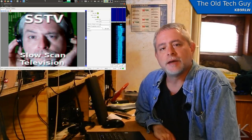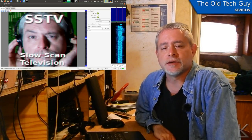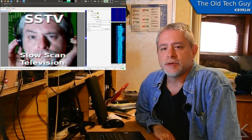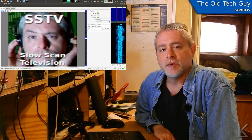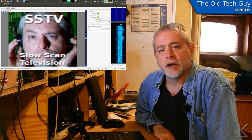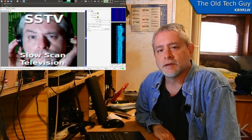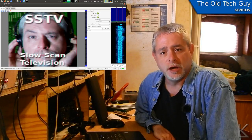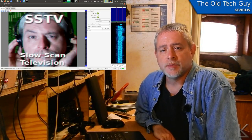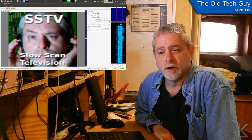It's pretty neat. I sometimes enjoy just leaving the software running on one of the common frequencies. There is a website that lists all the common frequencies. I'll put that in the description below as well. But the two most often used are going to be on 20 meters and 40 meters. And on 20 meters, you'll usually find slow scan analog on 14.230. And the DRM stuff tends to show up on 14.233.